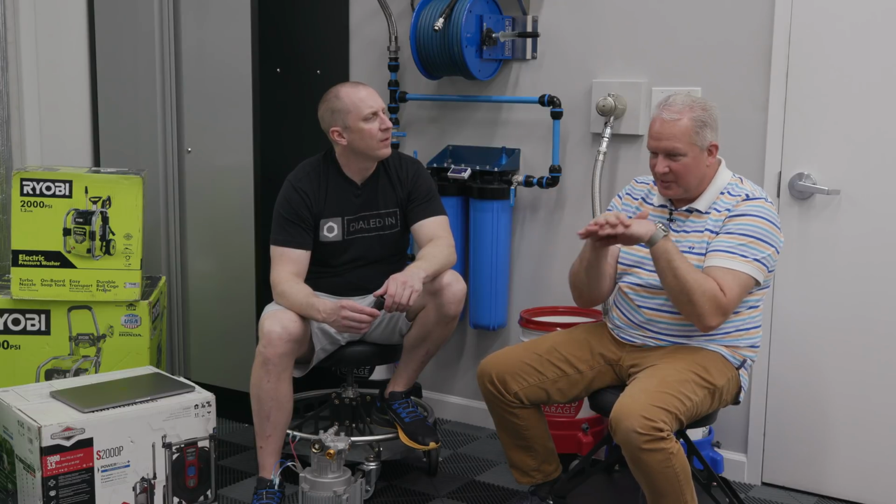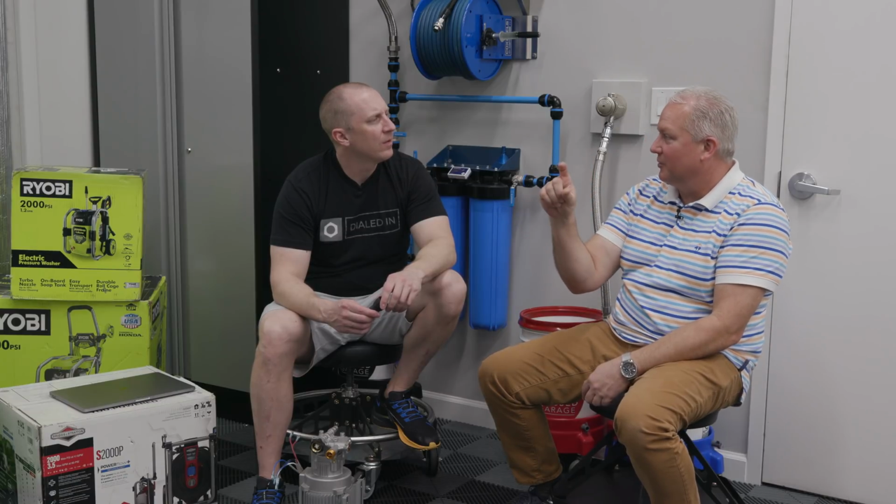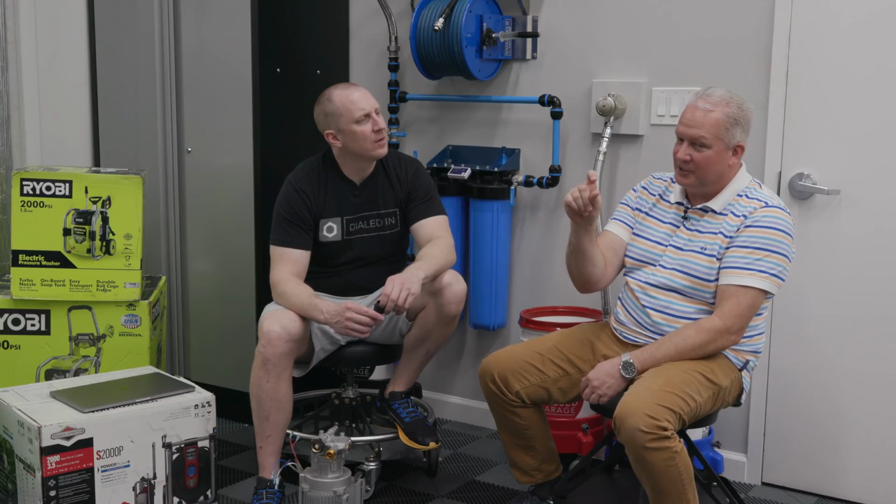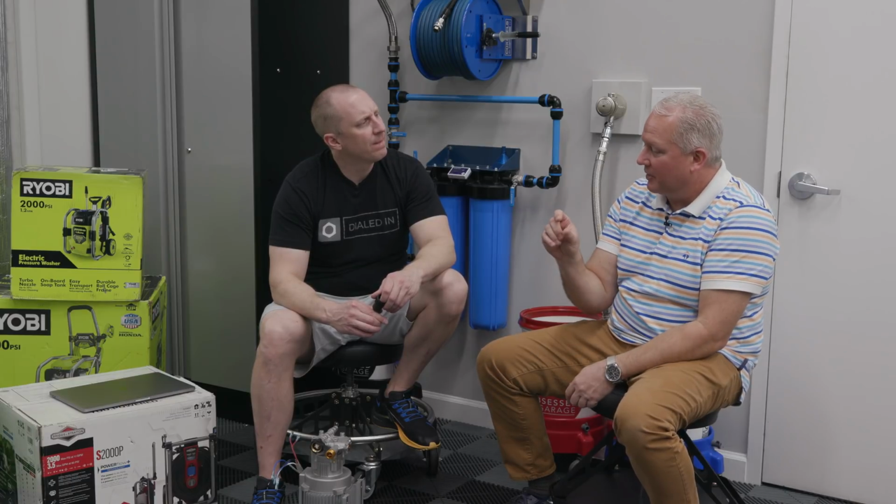And I think you might have touched on this before in some of your other videos, but the way the industry standard and that 301 standard work is that it's basically at 4,000 psi. So, just to have a baseline for all nozzles in the industry, they're all rated at 4,000 psi. Okay, got it. So if you have a 2.0 nozzle, basically it's telling you you're going to get 2 gallons on a 4,000 psi pressure washer. It's just level setting it, right? So a 3.5 is giving you 3.5 at 4,000 psi. Okay. It's just a way of having an industry standard and sizing the nozzles.